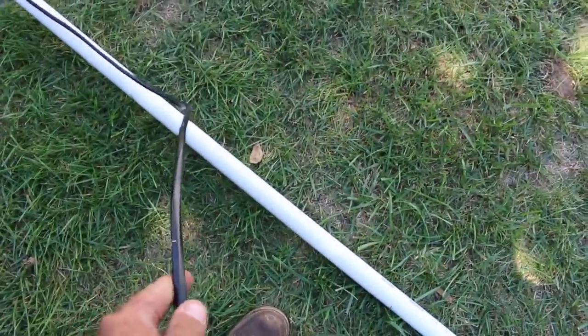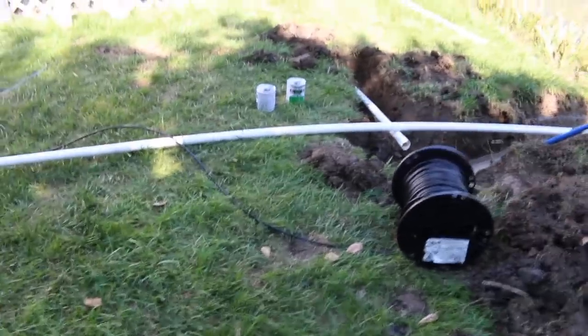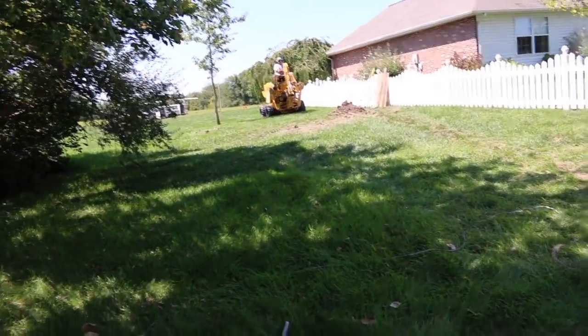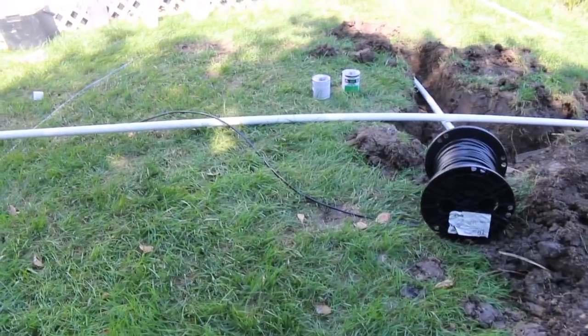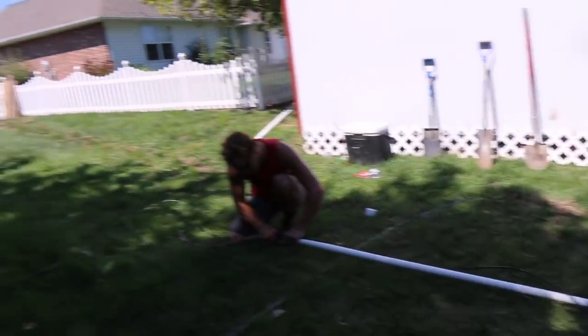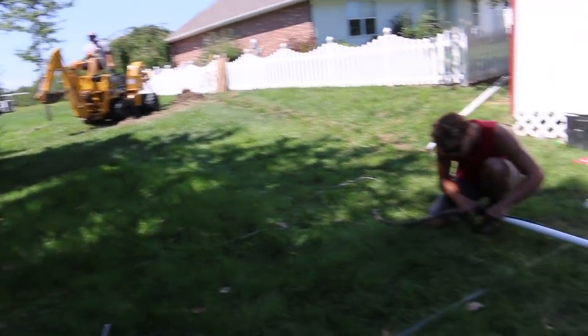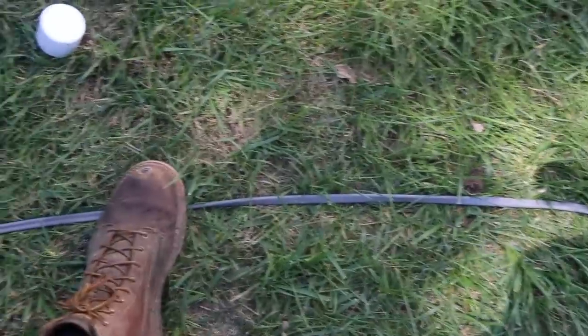And then Jake said that everyone runs their wire with their pipe, which I don't know how else you would do it, but you run your wire with your pipe. So whenever you get to your destination, you've got your wire there to tie in all your solenoids and all that, and it's got all your colors of wire in there. We'll talk about that stuff later. But basically, you got to get your main pipe and your wire to each of your boxes, and then you got to have all your wire coming to this building, which we've got this 220 right here under my foot.